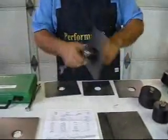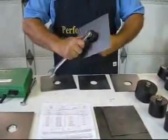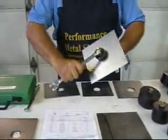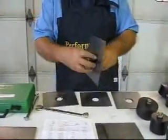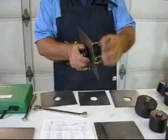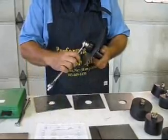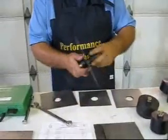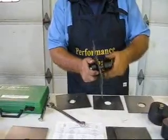We're going to take a 3/4-inch wrench and start the cut. One thing to watch out for is tolerances. On the automotive punch and flange tools, the punch-to-die clearance is 0.012 inch — that's a little more space, so it cuts heavier metal. With thinner metal it'll tend to bind and bend it up a bit. The aircraft, working with thinner material, has a tolerance of 0.007, so it'll cut the thinner material cleanly without leaving a burr or leaving the metal looking rough.